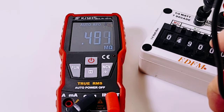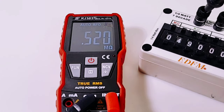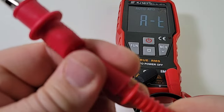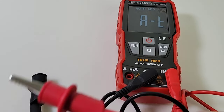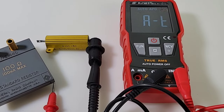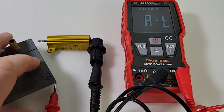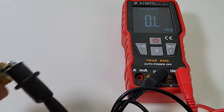As we get into the lower resistance range it does seem to pick up a little bit speed-wise, but yeah, this ain't no thoroughbred. Getting the alligator clip in there is really problematic — the negative probe is fine, nice and in there, but the positive is having issues. And for resistance it's kind of a fail because it just doesn't go any lower than 2 kilohm, so we can't really give it a good test there — it just kicks into the continuity feature.